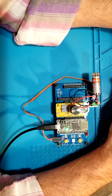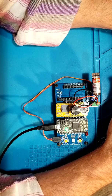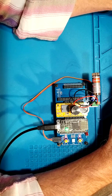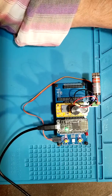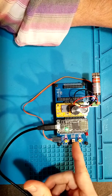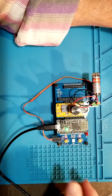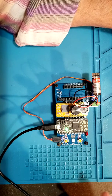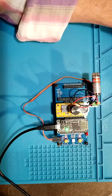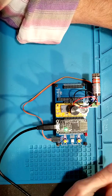One problem that we have almost every lab session is that these files, once again, need to be in the top level directory. One student actually didn't have them. They had them down in a folder, and they were not seeing these LEDs flashing, which is the first indication that code.py is actually running. Because code.py was in some subordinate directory, she wasn't seeing these LEDs flash. So we did a screen share, and I was able to look at her CIRCUITPY volume, and sure enough, there was a directory there. You should be seeing this at this point with the jumper in the red position and code.py running, these LEDs should be flashing.